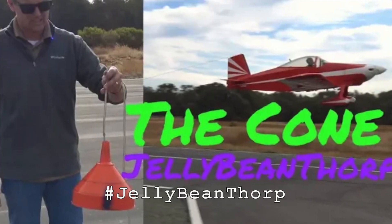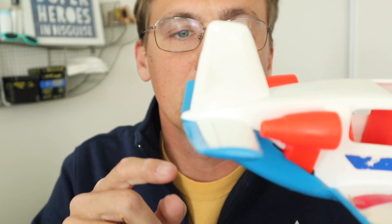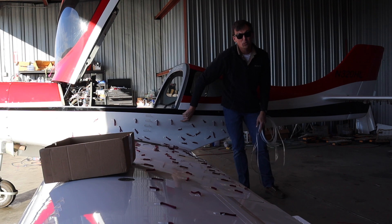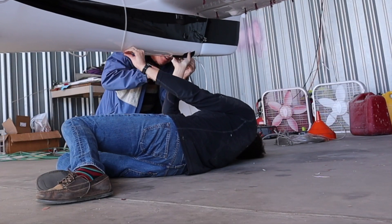For the Thorpe program we had installed the hose for the trailing cone across the top of the vertical tail. For the Lancer program we decided to go off the bottom of the tail cone because it was the most direct route. The gauge is inside the cockpit, so you have to get through the fuselage wall somewhere. The move of the day — all credit to Hawking — was using the old retired static port, which gives us a hole through the OML. We weren't going to be able to rely on a mechanical connection like an Adel clamp at the very aft portion, so Hawking and I decided to use Gorilla Tape at the very back of the tail, and glider tape to hold the hose.